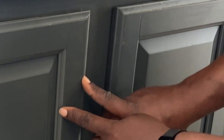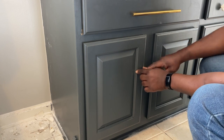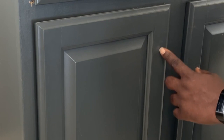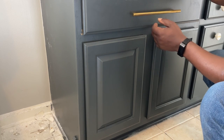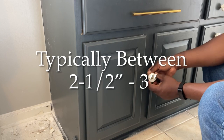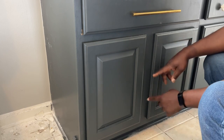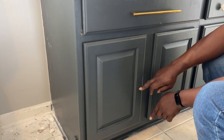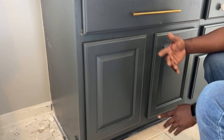For vertical pull installation, if you have a raised-panel cabinet, measure from right where the ridges are on the flat space — not the very ends. For shaker or flat-style cabinets, measure corner to corner. Whether you put the knob in the middle, up top, or lower is personal preference. If it's in the middle, do exactly what we did here but vertically. If you want it higher or lower, just measure your first hole and mark accordingly — it's the same process.